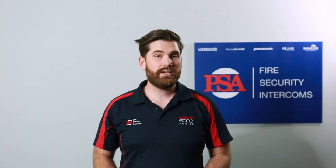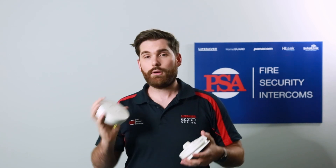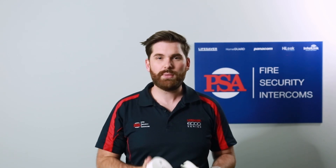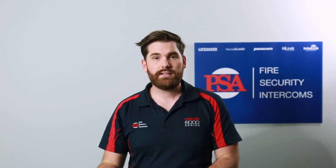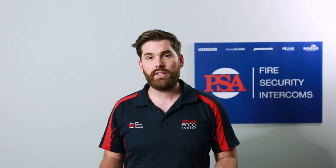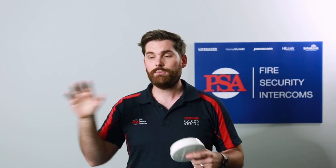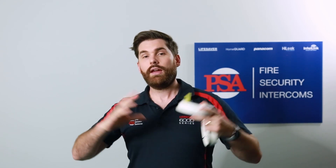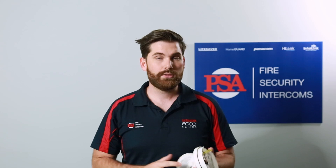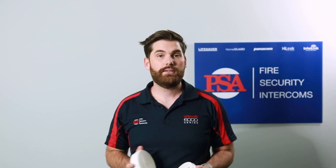It's important to note that you cannot use a heat alarm in place of a smoke alarm, as smoke alarms are designed to pick up on smoke from a smoldering fire — a fire that's beginning to burn. Most house fires are caused by smoldering fires: something that starts very small, burns badly, and produces a lot of thick smoke before it turns into a raging fire. That's why smoke alarms are preferred in houses, bedrooms, and living rooms — they detect a fire before it becomes the most dangerous, and can be the difference between life and death.